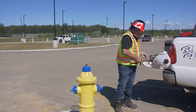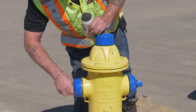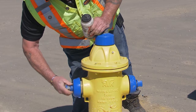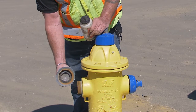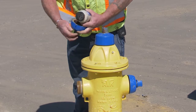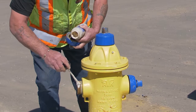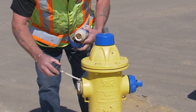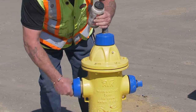When you're servicing your fire hydrant, it's always a good idea to take these caps off — just to see how dry they are. There's no lubrication at all. This just makes it easier for the fire department to get the nut caps off in an emergency situation. Paint a little bit of grease on it and put the nut back on.